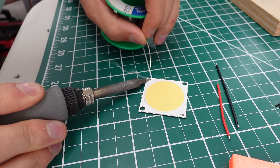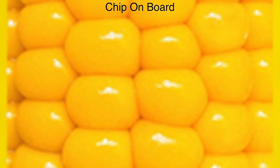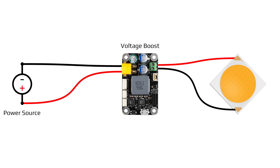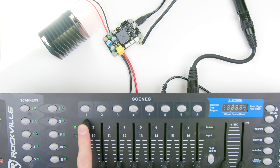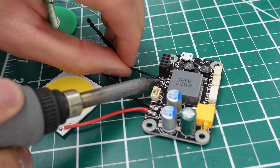After that, it was time to start the assembly. First, I soldered some wires onto the 200 watt COBs I'm using. COB stands for Chip On Board Array — it's basically just a bunch of little LED diodes wired together to make one big emitter. Next, I soldered the COB onto the LumiBoost. The LumiBoost is basically a high-tech DC to DC boost converter that lets you power the 60 volt LED off of 12 or 24 volts, and it also allows you to control dimming with an RC servo signal or DMX. Then I soldered on a thermistor for active temperature control. This allows the LumiBoost to dim the LED as it starts to get too hot.